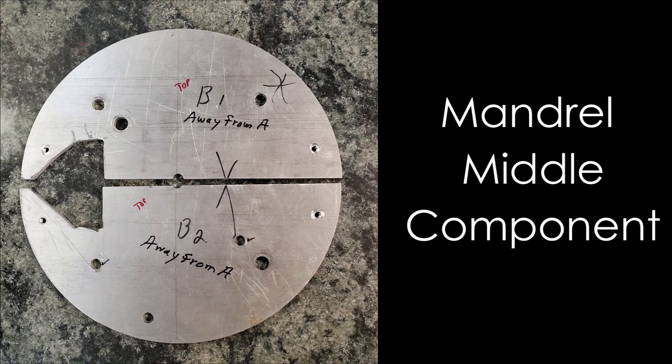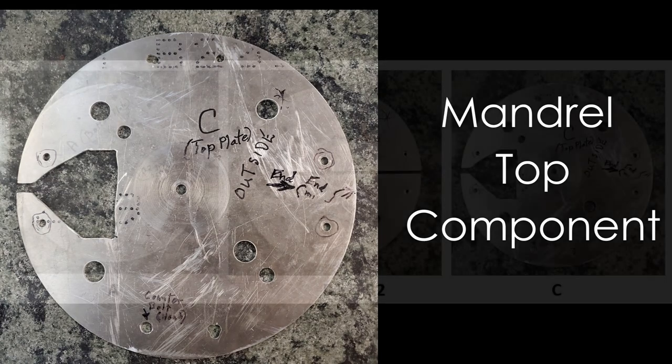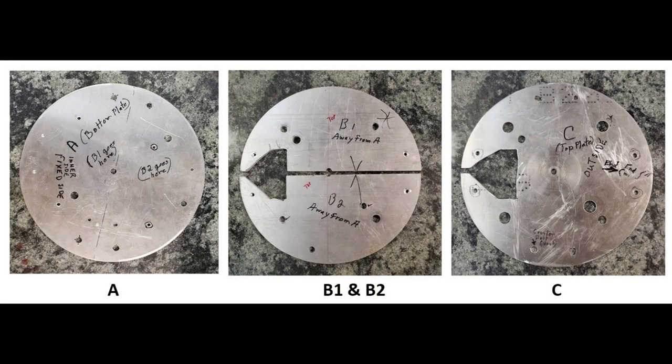And that's the crucial part: how you spread those two pieces, B1 and B2, apart to produce the right length band, which is wrapped around those two sections. So B1 and B2 are bolted to plate A at the right dimension to produce the right length band. Then side plate C is added to have an assembly of A, two B's in the middle, trapped with side C. Now, the cutouts to the left in B1 and B2 are there for mounting the tape, to hold the tape in place.